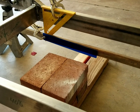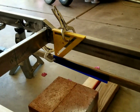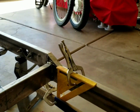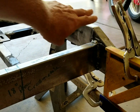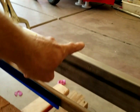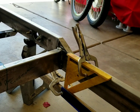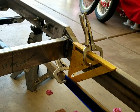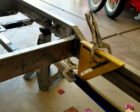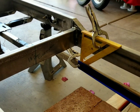We're laying out the floor, using the cycle car as a template. The bottom of the floor is eight inches from the top of the frame rail where the axle is. After subtracting the three inch on the frame, it's a five inch drop from the standard frame. I do bottom out a little going on trailers, but it gets your body down low — once you add a seat and padding it brings you up another couple inches, so the important thing is to get your body down as low and comfortable as possible.